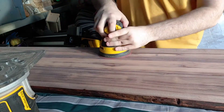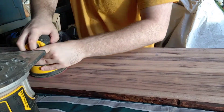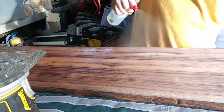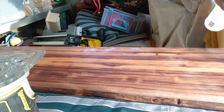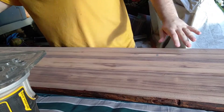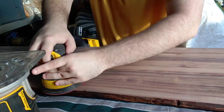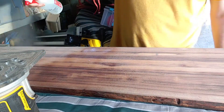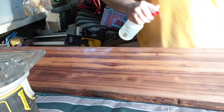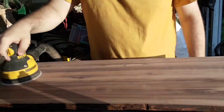I end up sanding going with the grain and against the grain, twice each pass. I have this sped up a little bit because sanding is really boring. At the end of 180 grit, I end up water popping it. The finish I use, Rubio Monocoat, suggests to stop at 180 actually, but I am bringing it to 400 when it's all said and done because Rubio Monocoat is traditionally a floor finish, so they recommend stopping at 180 so it's not too slippery. Now they say water pop after every grit, but it's a little overkill because you're just sanding away the same grain that you end up sanding anyways.